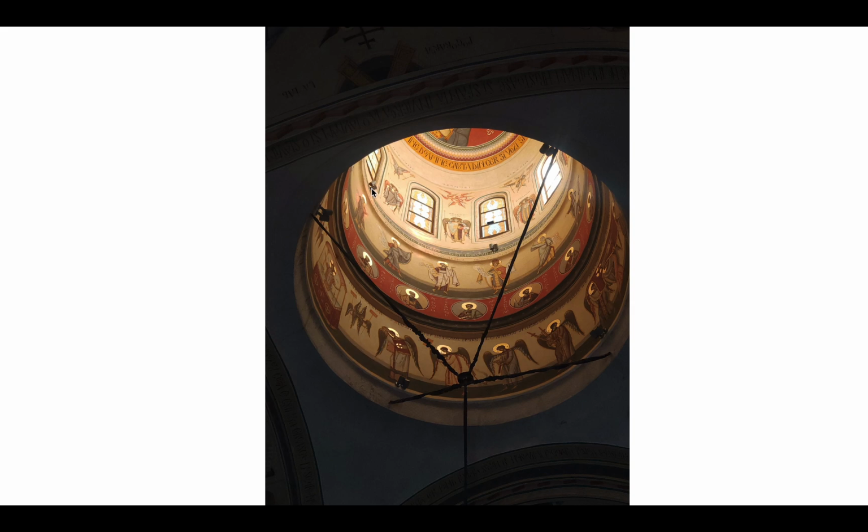And from the other 8 meters, you can see spotted here another two luminaires, here another two. Unfortunately you cannot see the other four, but the main idea was to divide the height into lighting sections, because if you just light from the bottom, you will need much more powerful, meaning bigger, projectors, and it will be related to uniformity. It's quite difficult to illuminate 18 meters from this point and use as small a lighting fixture as possible.